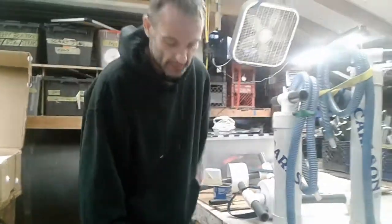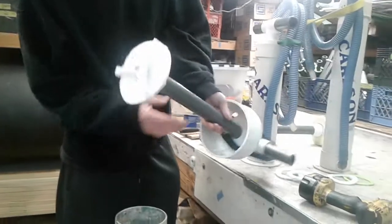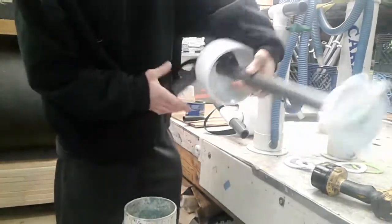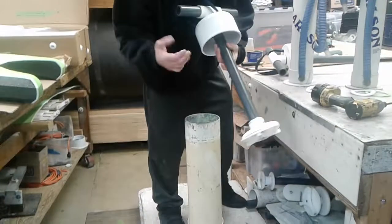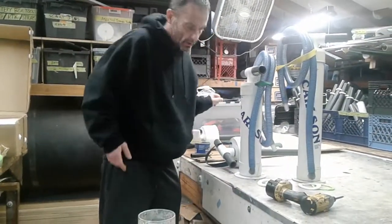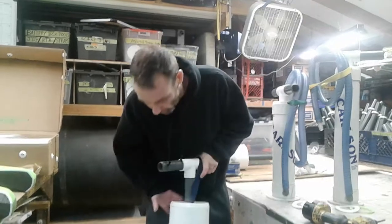If you have a six inch pump and you have a blue hose, then the inside guts are going to look a little more like this. This is the standard foam o-ring — the SDR 35. The shaft will be exactly the same, it'll pop right out the same. The testing method with your thumb over the hose is exactly the same.